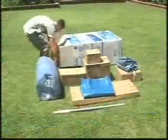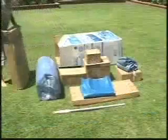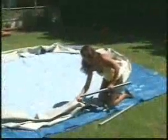Open the carton containing the legs and beams carefully, since it can be used for winter storage. Assemble all the horizontal beams and T-joints first before attaching any legs. Starting at any location, but always working in one direction, slide one beam into the sleeve with the flat side up. Center the beam between holes in the sleeve.